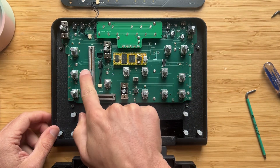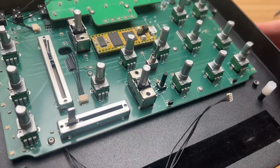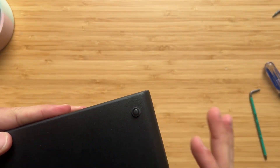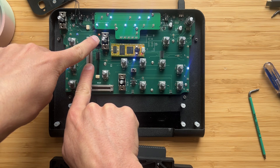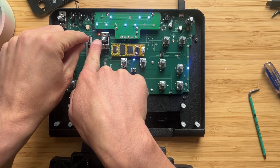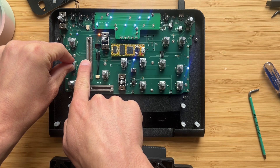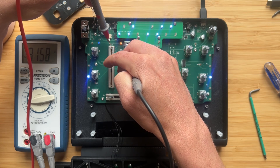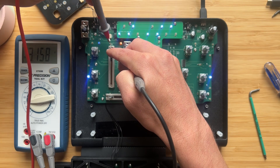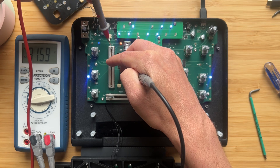Here is the problematic component. I'll give it a little look — maybe I'll just shake it and see if that fixes it. There's the envelope re-triggering and it's actually behaving as expected now. Oh, now it's borked again — still functioning intermittently. Now it's stuck at three volts. The fact that we're not getting the voltage changing as I slide the slider maybe indicates that the component is broken.